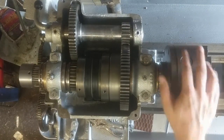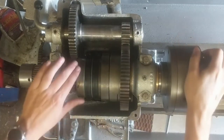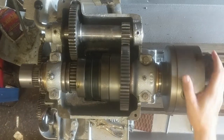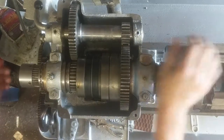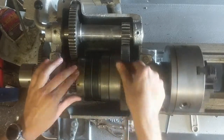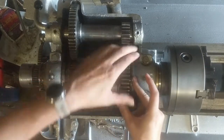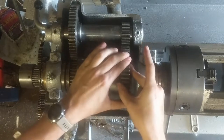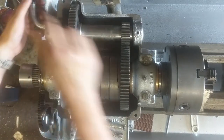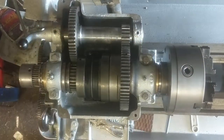We'll get started by taking off the chuck. The drive pulley here is freewheeling in relation to the main spindle. To get the chuck off, we want to lock this up. We make sure that the bull gear here is locked into the drive pulley with this little pin there, and then we lock the back gear into position. So now this has two ratios and will not turn.